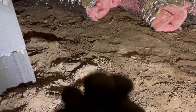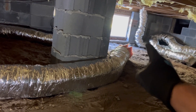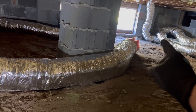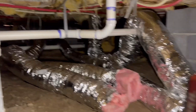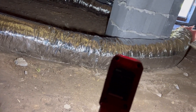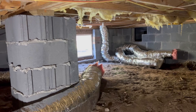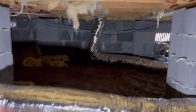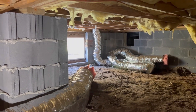This is where I was sitting during the last video, and I was facing toward where I'm sitting now. Looking out — there's the crawl space access. There's one lone boot over there; it's not critical if that one's long, it's not the only one in the room it's serving. If we put some flex going to a trunk that turns here and heads that way, we can catch all those flexes down there. It only has to go a little past that plumbing pipe, so 10 feet of 12 inch going this way would catch that one. You're supposed to clear an elbow by a little bit before you put another run or top hat off it, but I think we'll have enough room.